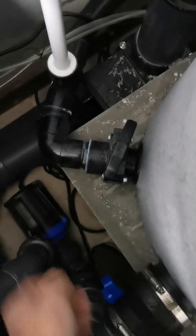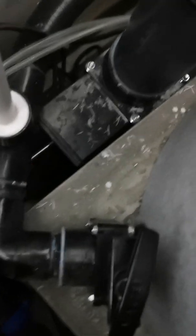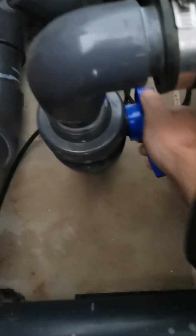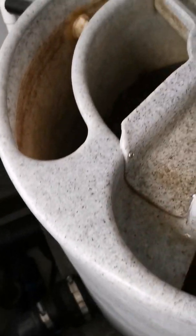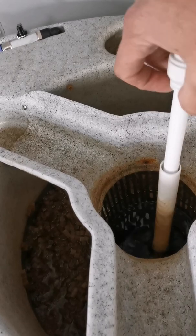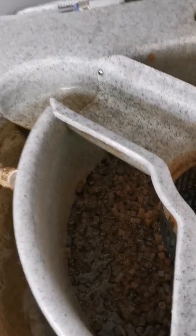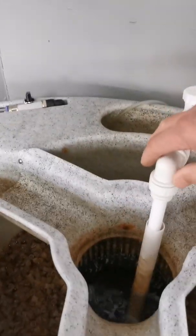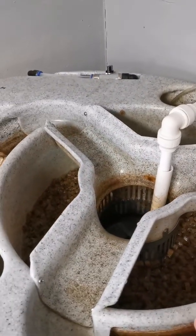That's that. So for the last time, shut the waste valve, open the 4-inch. God, hope I don't put on any weight because I won't get in here. Open the return. Now it's filling up. We've also got our auto top-up system running, as you can see, nice and slow through the dechlorinator. That'll take a good few hours for the pond to get back up to height.